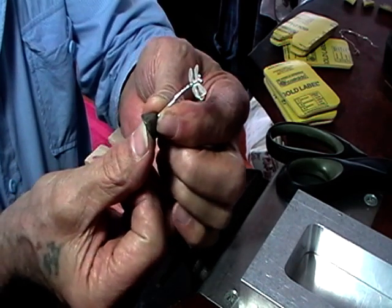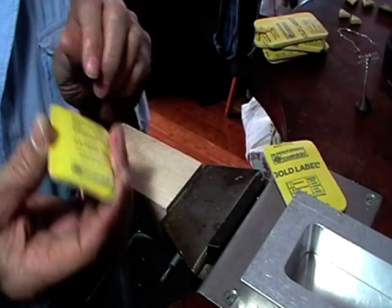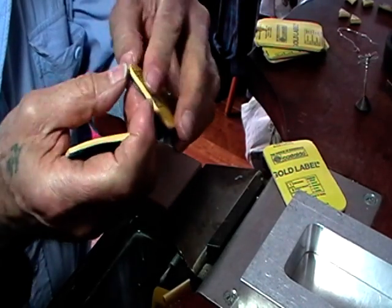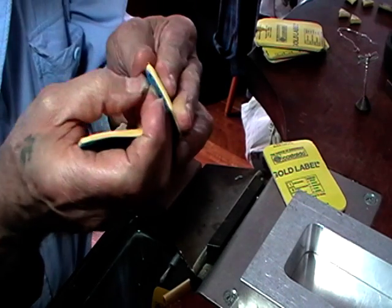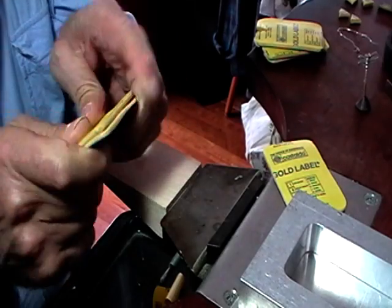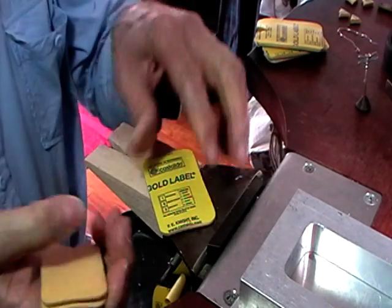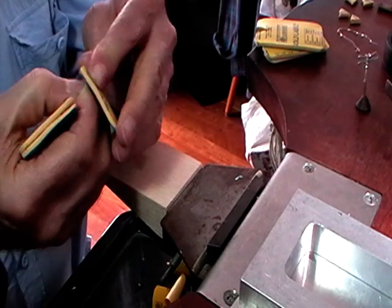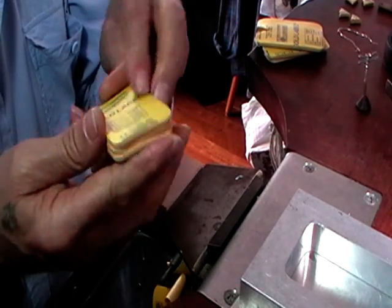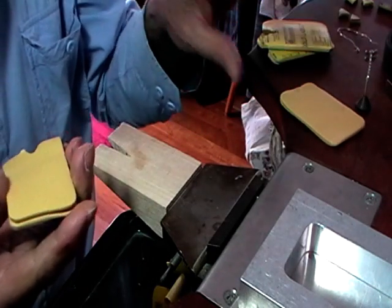It's going to sit on our piece like this and sit in that notch in the rubber. Leave two of the pieces without a cut. These bits of rubber are pre-cut — you can get them in strips that you cut yourself. It doesn't really matter whether you put the waffle side or the smooth side up. I prefer to have two smooth sides on the inside, but when you vulcanize this, it all glues itself together, so it doesn't really matter. The waffle marks will disappear.